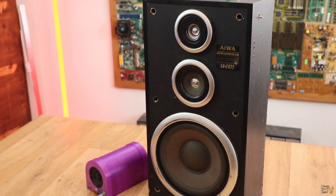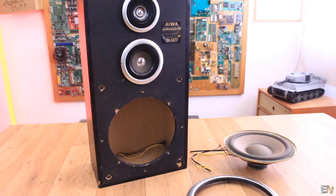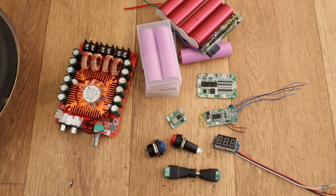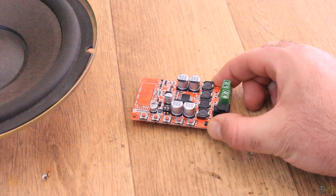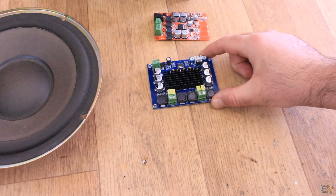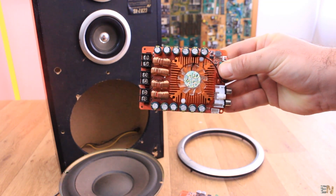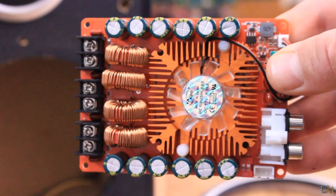What's up my friends, welcome back. This is the portable Bluetooth speaker from my last tutorial. I will use the same wood case and the speakers but I will change all the electronics inside, since the last circuit was not good enough. Last time I used this amplifier board with a TDA IC that already had a Bluetooth receiver on it. This time I bought some different amplifier boards, and I will go with this one that has a TDA7498E amplifier IC and a supply input from 15 to 36V.